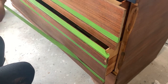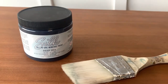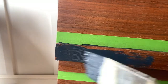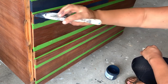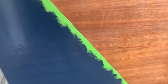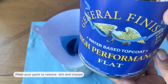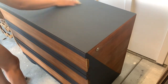Just a quick reminder that I let the damage dictate what I was going to paint, and that is what I did to create this fun design. I'm going to be using all-in-one mineral paint from Dixie Belle and a brush — nothing fancy. Both sides of the chest had some damage on different parts. On this side there was some damage on the bottom, so that's why I chose to go for this triangular design. I did the same thing to the other side. Now that my paint is fully dry, I can apply my top coat. I'm using High Performance flat from General Finishes, but before I start applying it I'm going to grab a tack cloth and start wiping my surface.